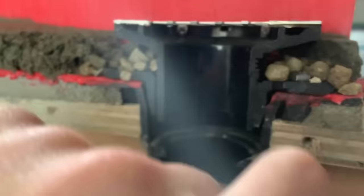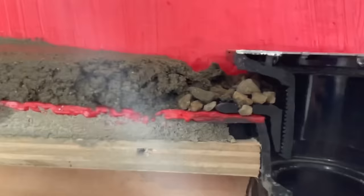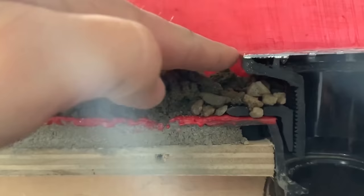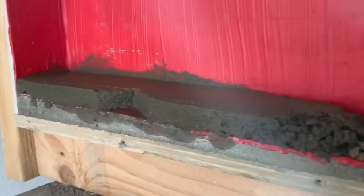So the weep holes are all protected here — just a thin layer over the top — and I come out around the clamping ring a little bit. You can see the way this is going to pack in between the drain and the rock. Pack that all in; all you need is just a thin layer. You don't need to build this up all crazy. Your drain doesn't need to be sitting three inches up in the air — just a thin layer to protect the weep holes. Then the deck mud comes across and I'm going to use a tile to gauge — a scrap piece of tile. I'm going to pack around here first before I pack anywhere else, to get this height set right. Pack the deck mud all around the drain tight, then use the scrap piece going around, and the piece should be flush with the top of the drain and the deck mud.